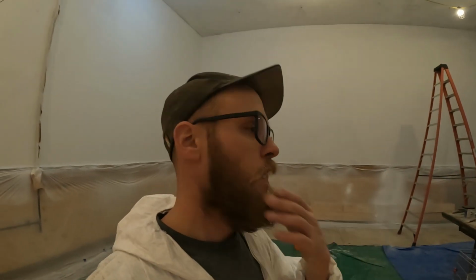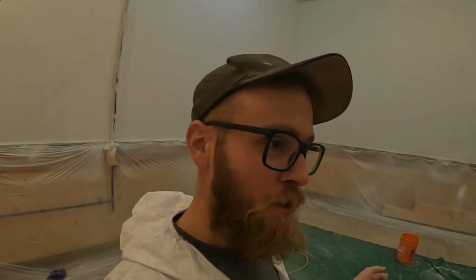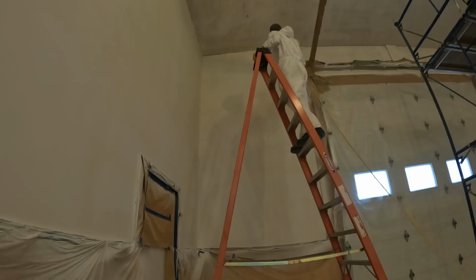And if you'll recall, we only did two coats of drywall. We did a tape coat and then a second coat. Ideally, if this was finished, you'd have a third finish coat of drywall mud on it, but we didn't do that because we're gonna texture. Then I wavered on that because we were trying to beat the weather, and I was like, oh, we're not gonna texture, it's good enough. Then we hit the road bump with us receiving the wrong paint. If you don't know what I'm talking about, you gotta hustle back through the channel and watch all the videos. But here we are, doing things proper, two coats primed. I'm glad we didn't compromise.